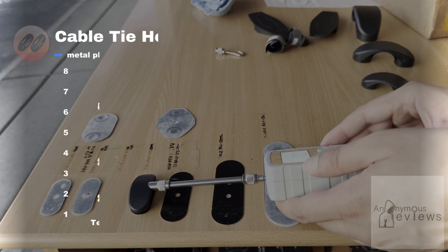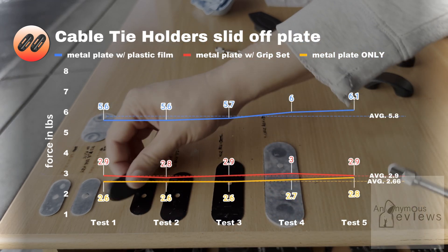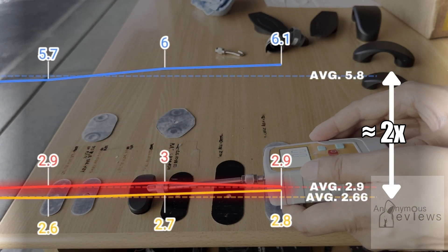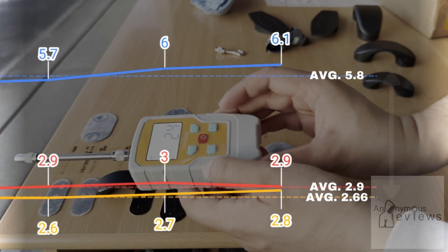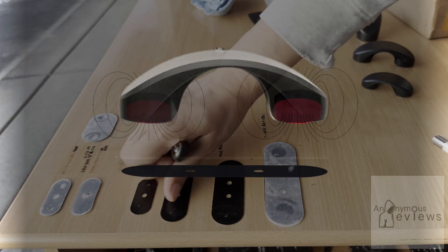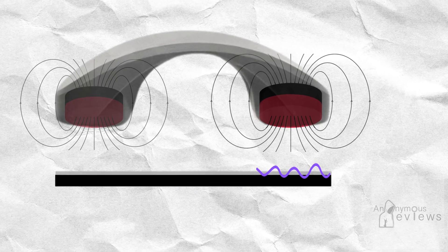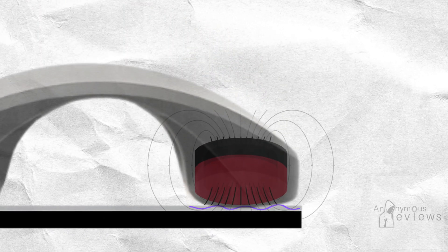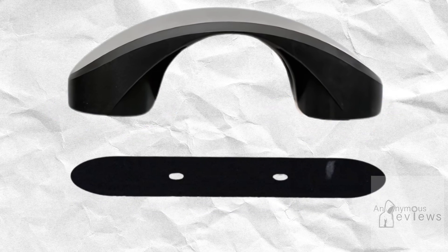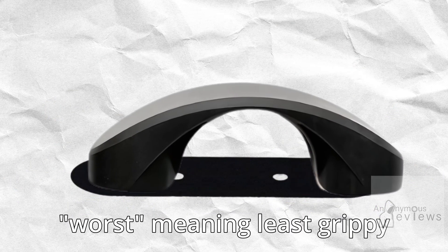The plastic surface makes the cable tie holders considerably harder to slide off the plate by roughly a factor of two compared with both the grip set and bare metal plates. At first glance this may be a little perplexing, but it starts to make some sense. The plastic layer is extremely thin, reducing the magnetic attraction between magnet and plate very little, while providing a very grippy surface. Compared to the bare metal plate, which allows for a strong magnetic attraction on a metallic smooth surface, I'm not surprised to see the metal plate faring the worst in the slide-off test.